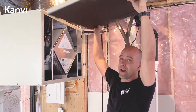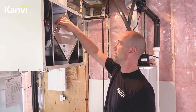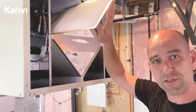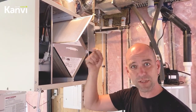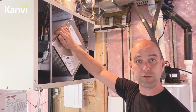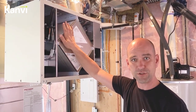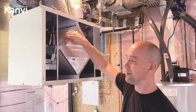Once it's open, you can take the cover right off and set it out of the way. This is the filter — there's your pre-filter for the air from outside. If this is dirty, that means the air coming into your house is dirty. Most commonly you'll find this get dirty in the mayfly season when those tiny flies come — they'll be trapped inside here and won't be able to get into your house. During pollen season this could get filled with pollen, so it's a good idea anytime pollen season comes and goes to check it. You want to check this probably every three months.